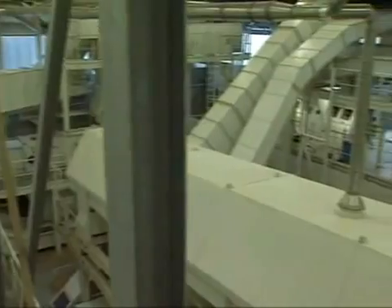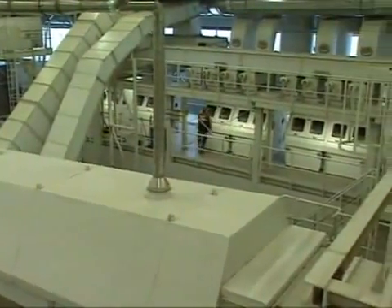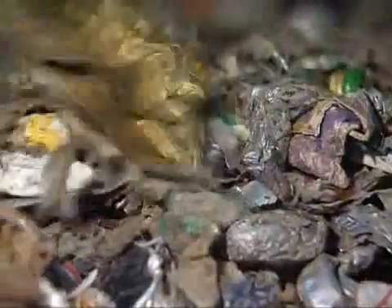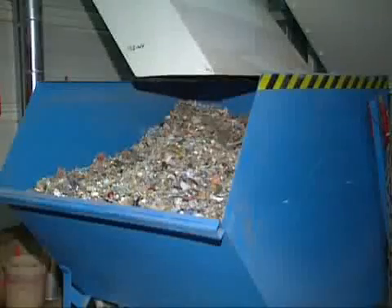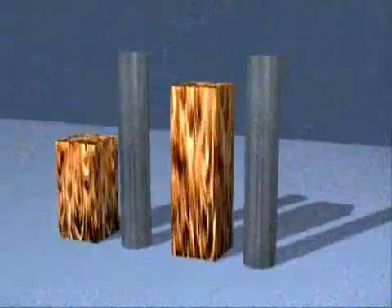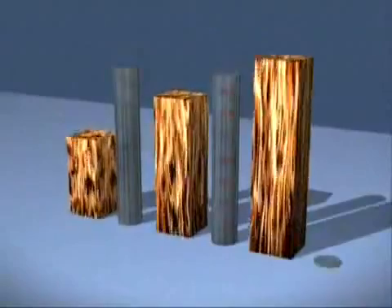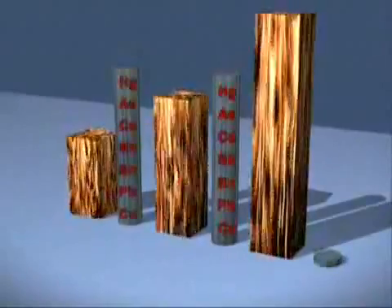This is the second key core element of the Stabilate process: waste separation. The dry and shredded waste is carried on conveyor belts to the vibrating sieves. Lighter, combustible materials like wood, paper and plastic are blown into the air. In order to obtain a higher quality for this fraction, metals such as aluminum foil are further separated out. Stabilate has an unrivaled position both in terms of its calorific value and its low heavy metal content — it has twice as much energy as raw waste and can be used as an alternative to high quality coal.